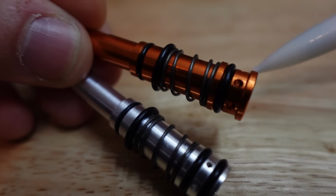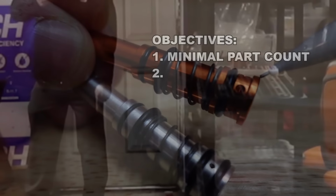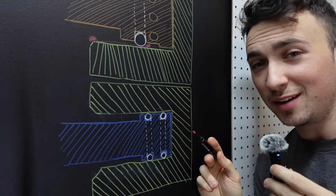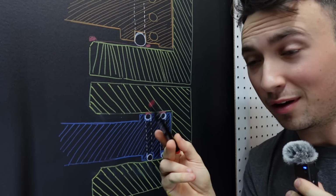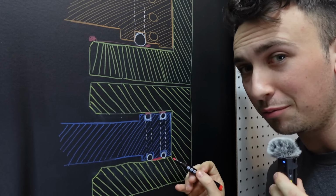Originally, we used one O-ring to meet my arbitrary design requirements. Part count low, but it turns out adding an O-ring here both increases efficiency and resolves the lubrication issue. With the updated nozzle, we still have to lubricate both O-rings, but this time, instead of spreading the lube back and forth until there's none left, it spreads it between these two O-rings and they constantly replenish each other.